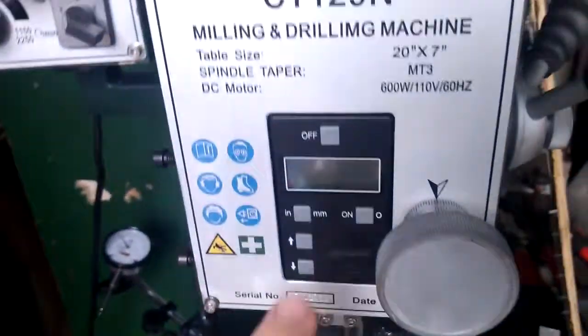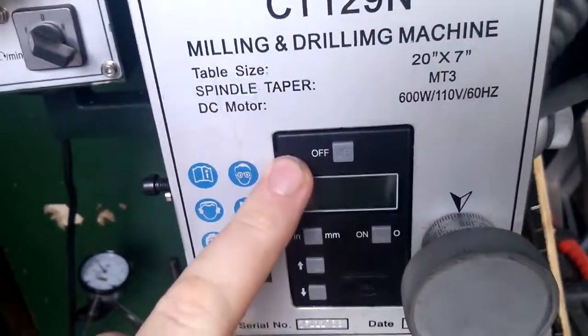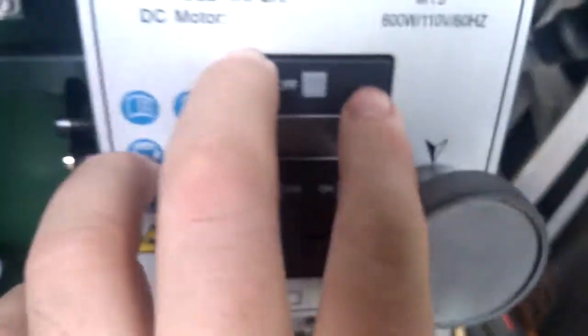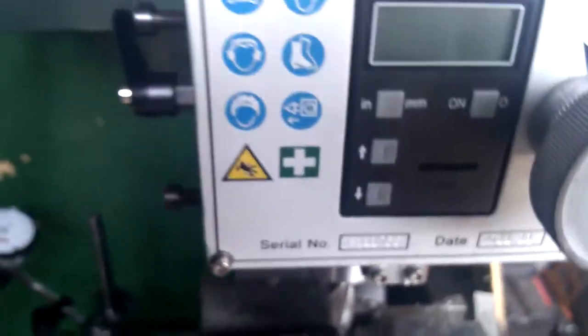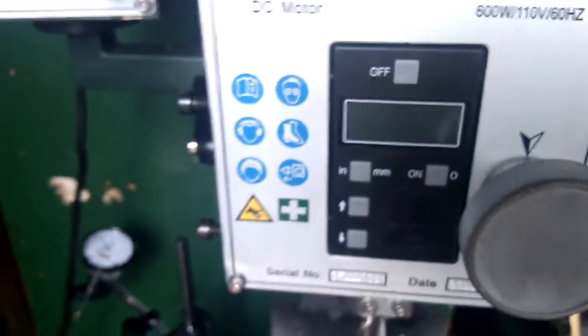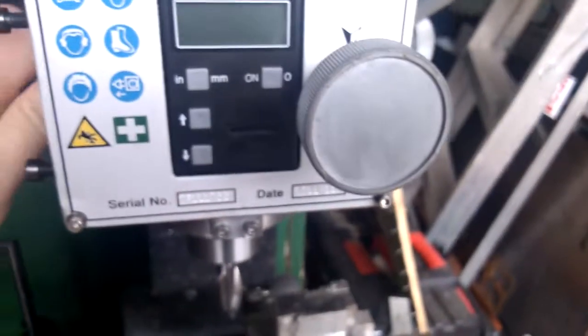You may notice I've taken off this little guard — it was proving to be a pain. The digital gauge wasn't reading properly, so in order to take it out I had to take that off. There's a hole there and a hole there with a couple of set screws, same thing over here, and that's what holds the whole gauge in place. So I took those out, found the gauge was all full of grease and cleaned it out, and it actually seems to be working okay now.